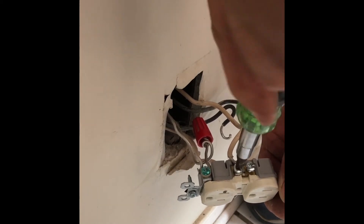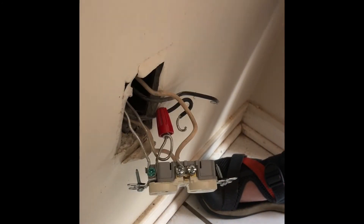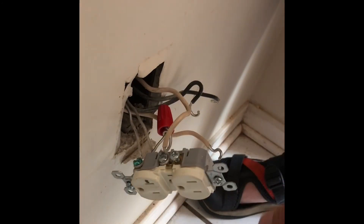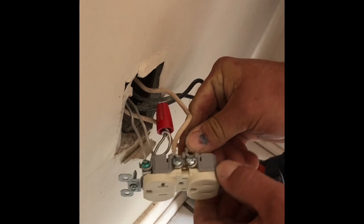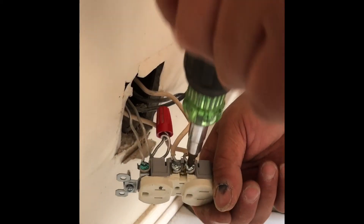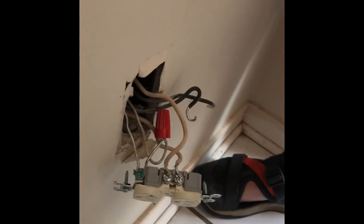Got to make sure the wire's in there and tighten it down real tight. And you've got to go back every year and re-tighten aluminum. This ain't your normal size wire — this is number 10 wire. Because with aluminum you have to upsize it a size bigger than copper. But at least whoever wired it knew that much.